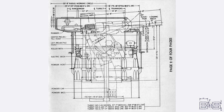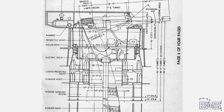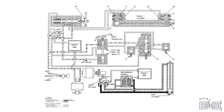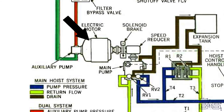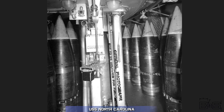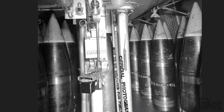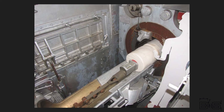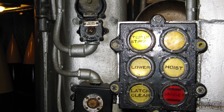Some differences between the 16-inch 45-caliber and the 50-caliber: the 45-caliber only has four hoist stages, but the 50-calibers of the Iowas need five stages to accommodate for the added height. Instead of the 10-horsepower motor for the cradle and a 60-horsepower for the hoist, the Iowas have a single 75-horsepower motor on the electric deck that runs both pumps. The older 45-calibers also had a safety stop lever and a mechanical interlock system — a sign would show 'hoist' when it's safe to raise another projectile and 'danger' when the cradle is open. This was later replaced with an electric hoist control indicator.